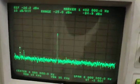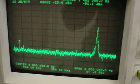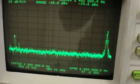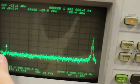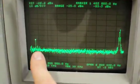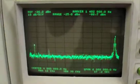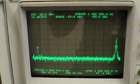Now notice how down here, nice clean signal, but up here, lots of harmonics. There's also this other signal bouncing up and down here. That is KVTO at 1400 kilohertz, an AM station. About 1 kilowatt, 1.5 kilowatts, and it's only a couple of miles from my workshop.